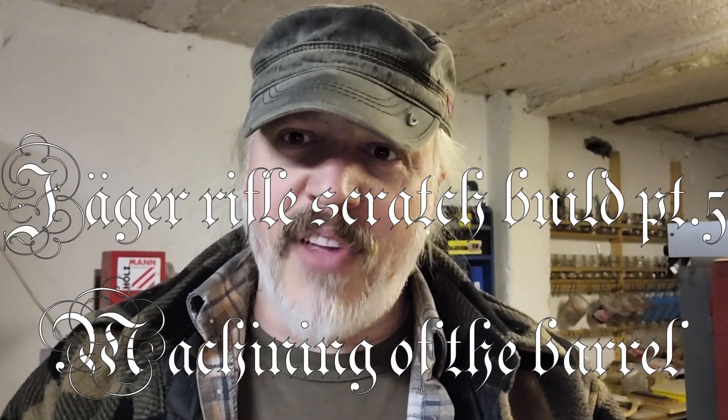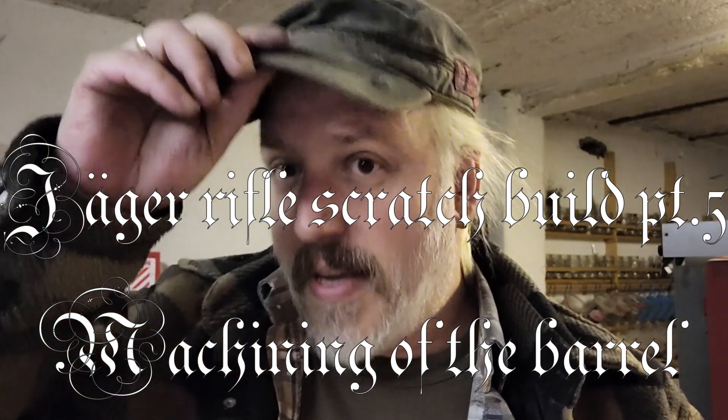It's time for a new gun making video. I did some more rounds of reaming on the barrel with a completely different reaming bit setup. Thanks to my subscriber Chris, he gave me the idea to change the wooden part to brass, and that works way better. I had the fear the brass would wear out and cause scratches due to rotation grabbing the cutting chips, but it's not like that — the adjustment is now way better and much more reliable.